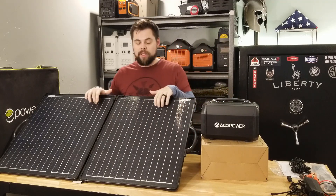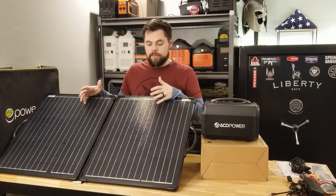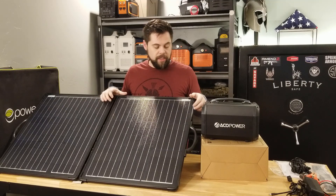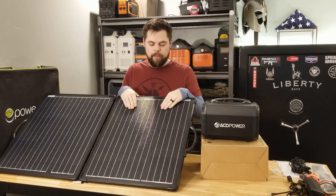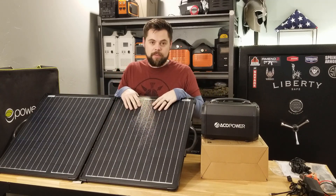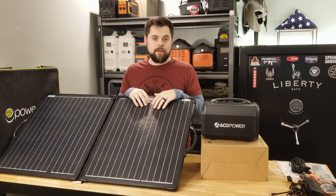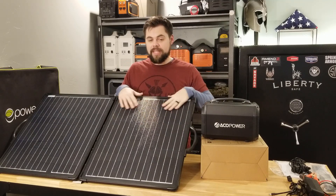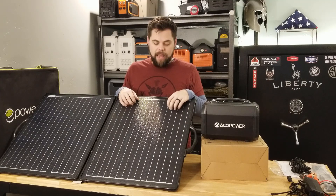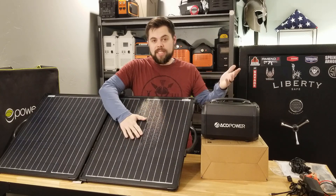With this unit, they also sent out this 100 watt solar panel. This is actually pretty cool — most foldable solar panels tend to be pretty heavy because they're still using two 50 watt panels with tempered glass and aluminum frames. This still has the aluminum frame, but it's technically a flexible panel with an ETF finish. You do not want to get flexible solar panels with the PET finish — that plastic is like what's on a disposable water bottle, and after six months to a year it'll discolor, flake, and break down. The ETF finish is designed to last over 20 years and is very scratch resistant.